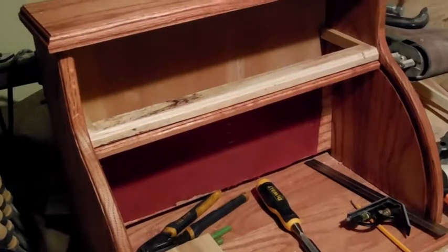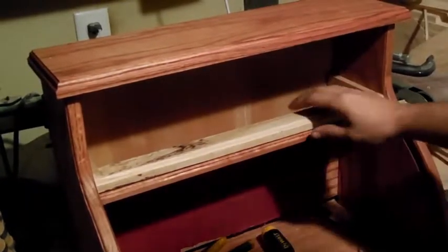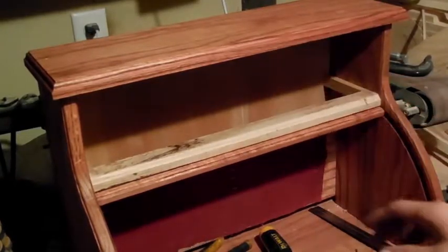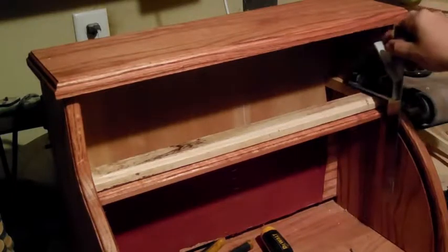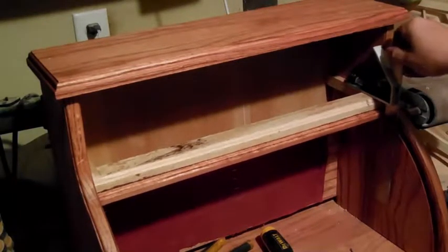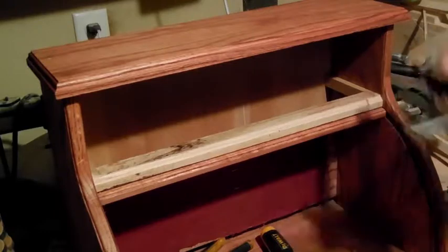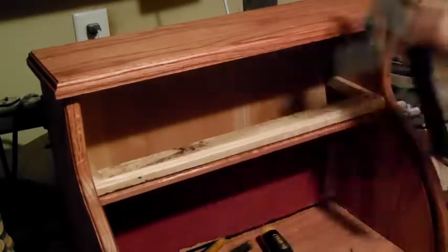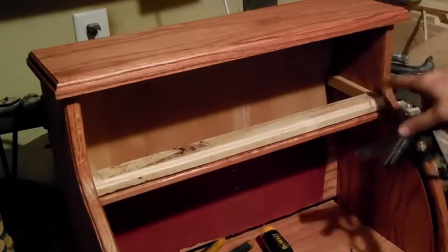Before we go back out to the table saw, let me give you a quick overview of what I've done. Everything is still loose — I wanted everything loose and fluid so I can move and adjust it. I put a level on here and adjusted it to where the runner was level. Then I put a little pencil line on the inside wall so that I can pull this out where I can get to it, to get an accurate measurement between the bottom of the top and the top of the runner.